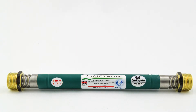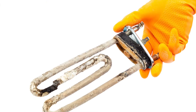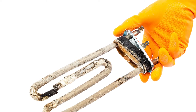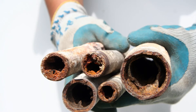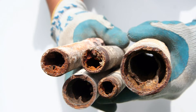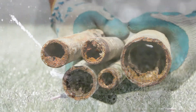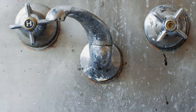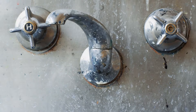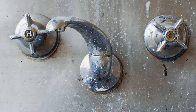It is great for any type of water where the minerals in the water are creating a mineral build up called lime scale. You will see these mineral deposits in different forms. It builds up inside your incoming water pipes to your home and slows the pressure and flow rate. Outside it blocks the sprinklers and stunts the garden growth. It can create a fine white powdery crystal growth on your tapware which eats the metal away.